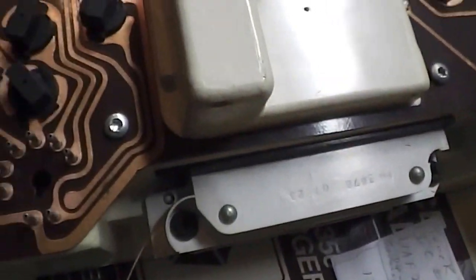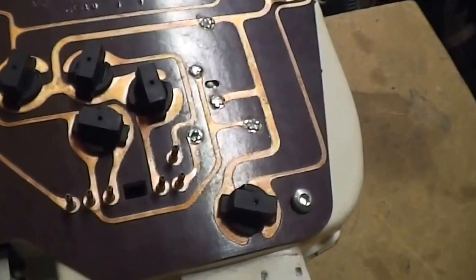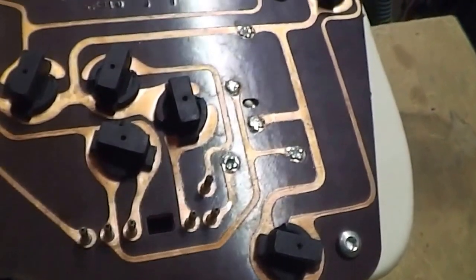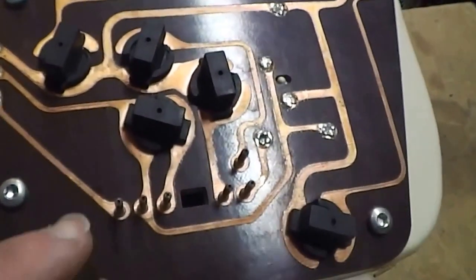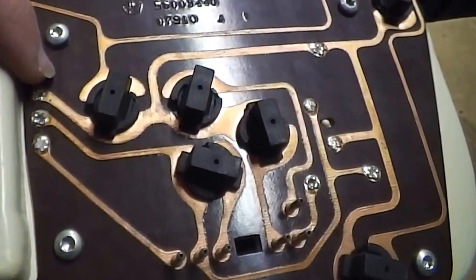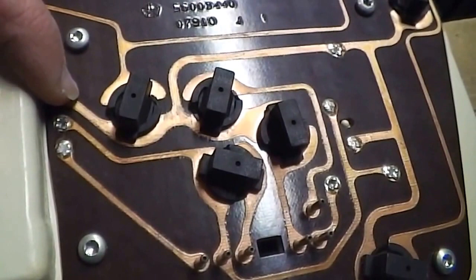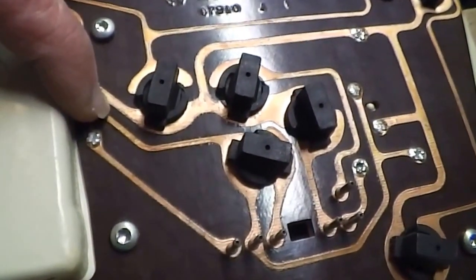I got one from China, just to be sure, so that when I finally do figure out how to test this thing, I'll have any parts I'll need. Here is an L connector that comes onto the printed circuit board in the instrument cluster. It's this pin right over here that goes to where the speedometer plugs on. This top pin is ground, the next pin down is your 12 volts, and the last pin down is the speedometer drive signal.